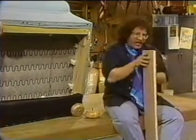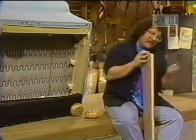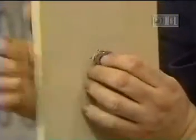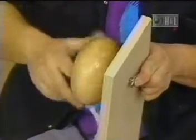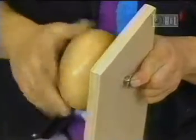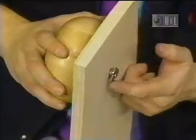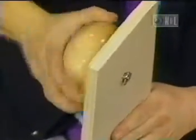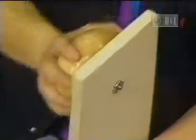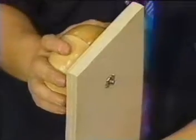If the nut isn't inside, you have to go to the hardware store and take your leg with you so you can match it up. Here's the new T-nut. This is a mock-up of what the chair looks like inside. We fish around, put the T-nut up against the hole with one hand, and then begin to screw in the leg — this is a bun foot. You'll be flying blind in real life. And as you tighten it, these teeth start to grab and cut into the board, keep biting down until you can't do it anymore.